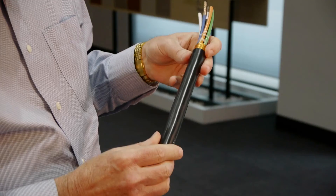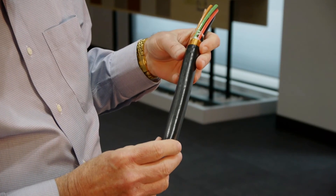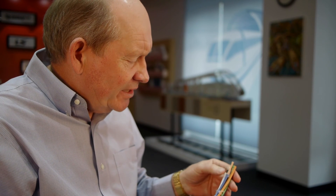We also offer a steel shield if the customer prefers that, and it's encased in a PVC jacket. The other two options are a stranded loose tube cable, which many people prefer for its use in normal fiber applications, and also a tight buffer design which does not include any gel. Some people find an advantage where there's no gel in the cable, and tight buffer cables can be connectorized faster and less expensively.